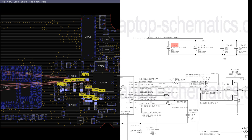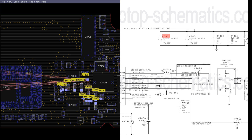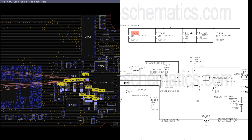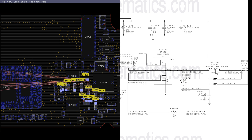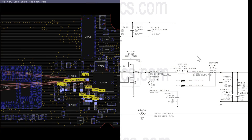A transistor can turn on-off, on-off, on-off. This chip over here controls this transistor, so you get some 8, some 0 — some of the 8 from up here, then it closes and you get 0. Through this coil it gets averaged out, so instead of having a bunch of 8 and a bunch of 0 alternating, you just have it averaged out to 1.3 volts. These capacitors provide the smoothing down here.